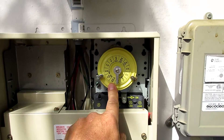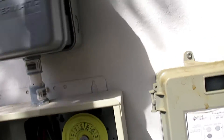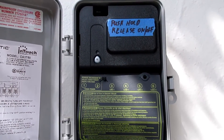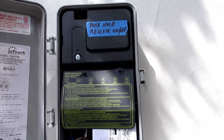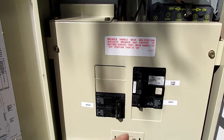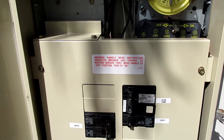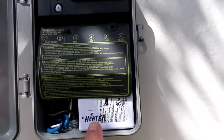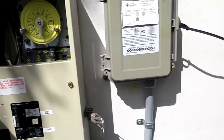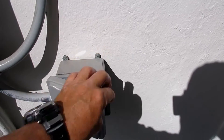Basically what I did is replace this timer with a Z-wave relay which is up here. It's a dual-throw high-current Z-wave relay I've been using to control the heater on and off with this breaker. When there's nobody here for six months the pool still needs to run, but I can turn off the heater now with this Z-wave relay.